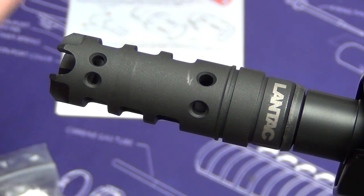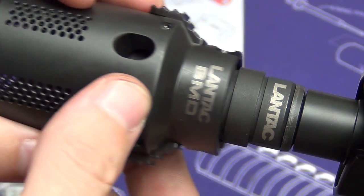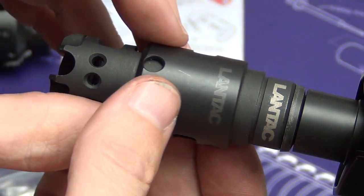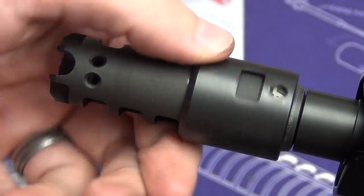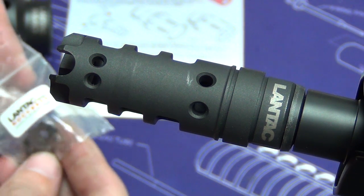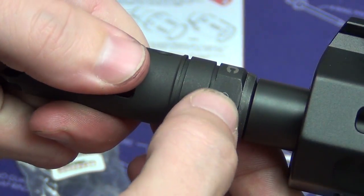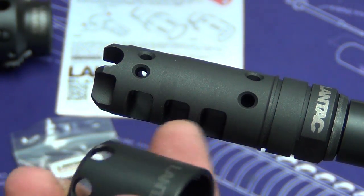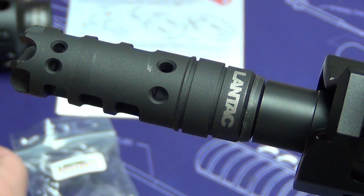In the packaging you're gonna have the BMD and also the sleeve, because you can't attach the BMD directly — it'll just wobble around. So you have to install the sleeve first. The sleeve is very simple, it just goes over and these two ports line up with those two ports. Then we're gonna lock it in place with some shims, and the shims are what's going to be a little bit tricky — they have to be on either side on either flat spot, and then you have to slide the sleeve over both shims, which can be tough without them falling out of place.